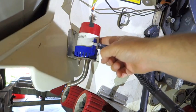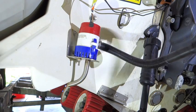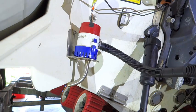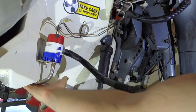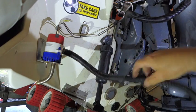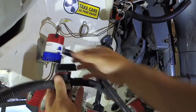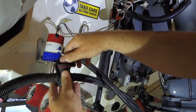Now leading from this, I've got this flexible plastic hose, and because I've got the pickup scoop, I don't want the water to continually flow up into the live bait tank. So when the boat's moving along, the water comes down under the hull, gets caught in this, flows up through and pumps without the bilge pump being turned on. I've got a stop valve that I can turn on and off to allow the water to run through or not run through.